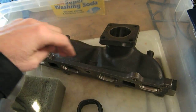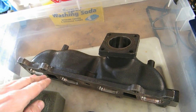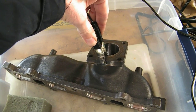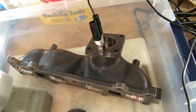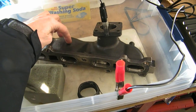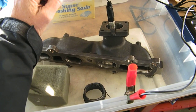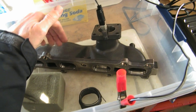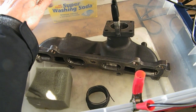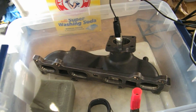Before I put the wire through, I got some foam and cut little cubes. I stuck the wire through the cubes of foam so that when I pulled the wire through, there were foam cubes positioned along it to keep the wire from touching the part. Then I connected the negative to the part itself and switched on the battery charger. The rust on the inside went directly to the metal wire because it was the positive — the wire got all rusty and took all the rust off the inside of the manifold. That made it a lot easier to use the grinding stones, sandpaper, and rotary tool to remove material on the inside.